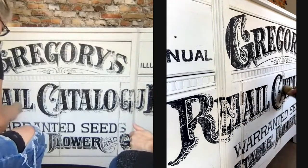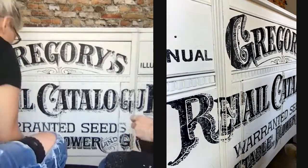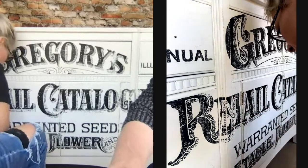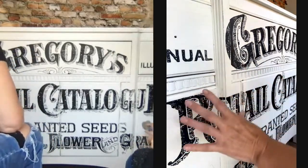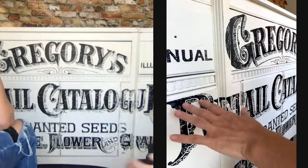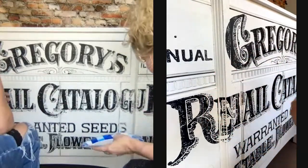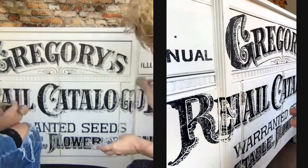Not to get ahead of ourselves about this, but since we're doing the clear wax, it's worth noting that if you want to introduce dark or black wax into your surface, clear waxing first gives you more control with your darker wax. Especially on really porous surfaces, which this is no longer super porous, but it still stands. The clear wax almost creates a base of a movable clear, so that you've got more movement, kind of like how water gives you more movement with your watercolor pigments on a surface. It doesn't just suck it up immediately. So we always do clear wax before, and it makes the whole process more forgiving.